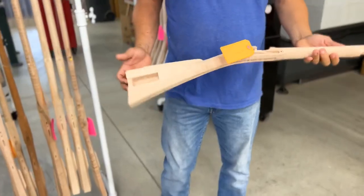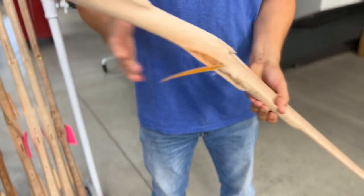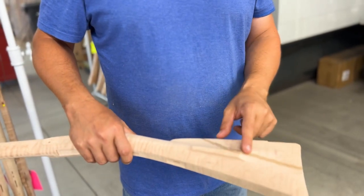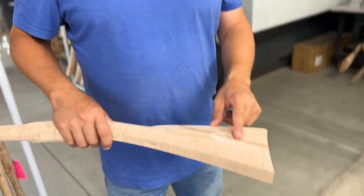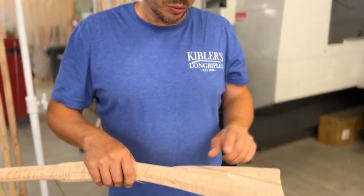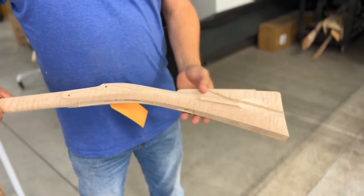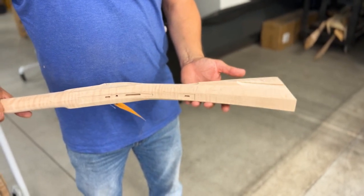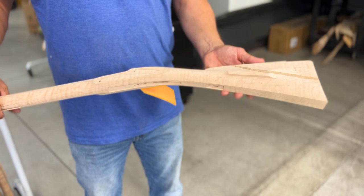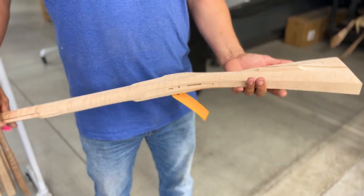Here's a very beautiful piece of maple with a lot of curl and figure. This could be heartwood, although it also could be a stain from worm damage. I'm not exactly sure — probably a little streak of heartwood. I don't see any wormholes. Usually when you have a little bit like this, you stain it and you probably won't notice it. I'll probably try to bleach it a little bit too to tone it down. It's a very beautiful piece of maple with nice medium curl throughout and should take a very beautiful stain.